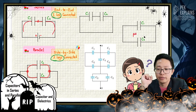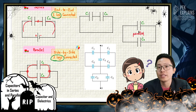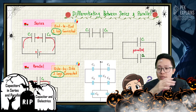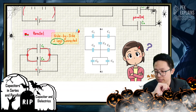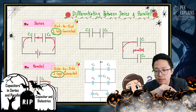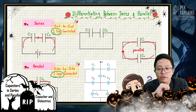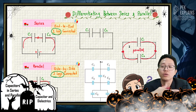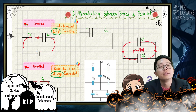This is parallel. Although it's only a single circuit, it's still a parallel combination. Saying that a single circuit is always series is the wrong concept. We look at the legs. For these two capacitors, the left leg of C1 is still connected with the left leg of C2, and the right leg of capacitor 1 is also connected with the right leg of capacitor 2. Both legs connected — two legs connected is parallel.